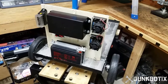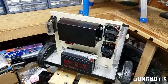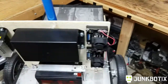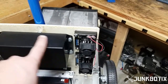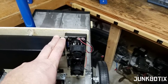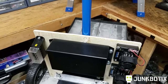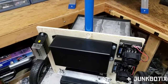What we're going to do next is actually start wiring things up. One of the first things I have to do is lay out the layout and fabricate the panel that'll go onto this enclosure here. The way I'm going to do that is kind of old school style — using a piece of graph paper to lay out everything. Then I'll transfer that onto the surface here using some spray glue or something, poke the holes, and drill it all out. That should cover it.